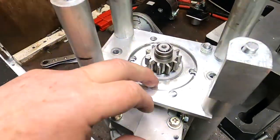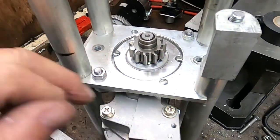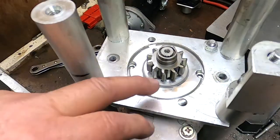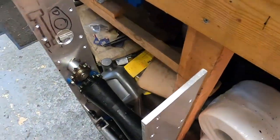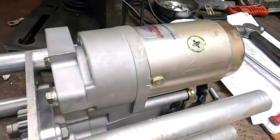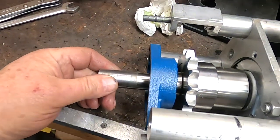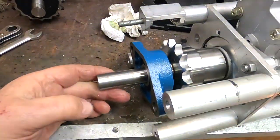I've very carefully spaced this part here into this machined surface, which was carefully positioned on the center of this plate. This received nicely — the register here — but the register on this is different, so I had two options: either make another plate or space this out very carefully and then clamp it up and check. I'm happy enough about that. This is now ready to go into the plates which are down here, and that's the next stage. This just gives you a view of this contraption where it is going to go in here — a little bit of slack so that bearing is lined up at the edge. This is all going to fall into place I think, so the next stage then is the chassis frames.